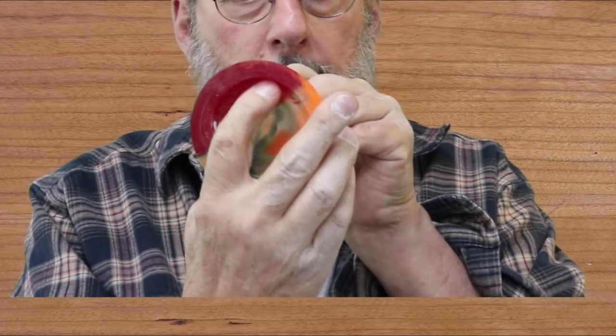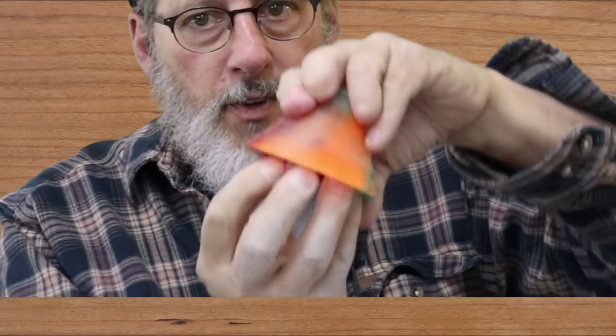Marvellous mushroom mold — that was a fun project. Somebody was asking they would like to see me chuck this up, and I started to actually turn this a little bit and I'll probably make a video out of it. I was thinking about making a birdhouse. What I've got on the inside is a little ledge, like a shoulder, and that's where the birdhouse will fit up and get glued. I can use that as an expansion recess and put that on a scroll chuck and turn it. That question came from Rodney Stewart — thanks for the awesome video, and he's very interested in how I'm going to attach that to the lathe.